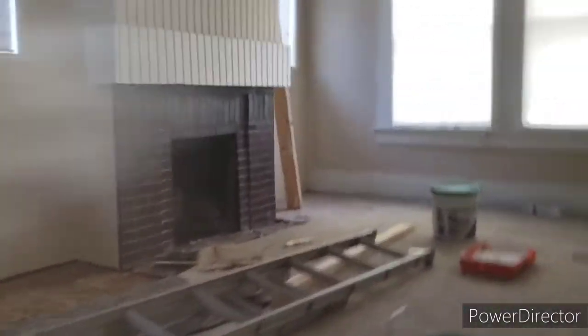I might have to pull up the floor right here to get some jacks under this wall. They've already cut a hole for the access stack so they can get jacks under there. But mainly, the middle of this house is just sunk. It seems to do a belly like this as well under here.